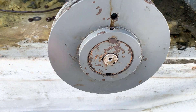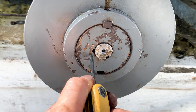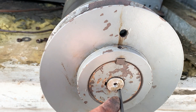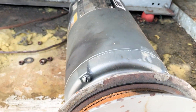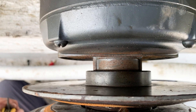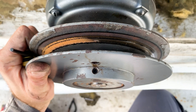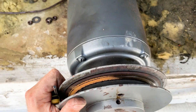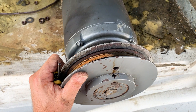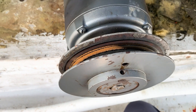I checked the wiring and it was correct. But as you can see here, the keyway isn't in there — that's a problem. This thing spun. I'm right up against the motor and I can't spin this. It could be that it's just so damaged internally that it won't spin, but I can't get it to budge. So I know this pulley is not in great shape. We'll address that later if needed.